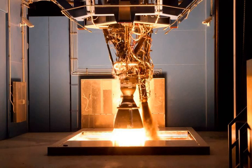The Merlin 1A turbopump used a unique friction-welded main shaft, with Inconel 718 ends and an integral aluminum RP-1 impeller in the middle. The turbopump housing was constructed using investment castings, with Inconel at the turbine end, aluminum in the center, and 300 series stainless steel at the LOX end. The turbine was a partial admission impulse design — working fluid admitted through only part of the turbine's circumference — turning at up to 20,000 rpm, with a total weight of 150 lb.